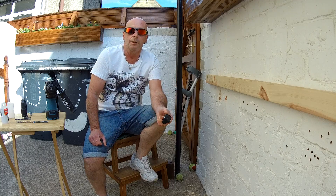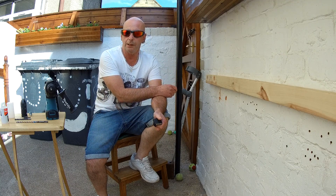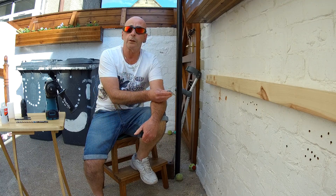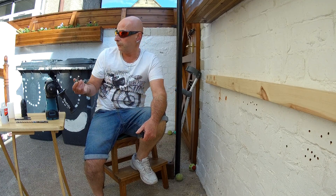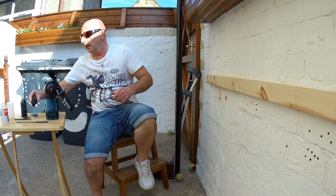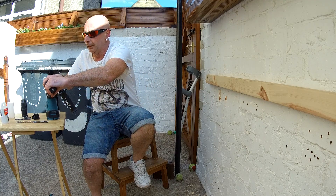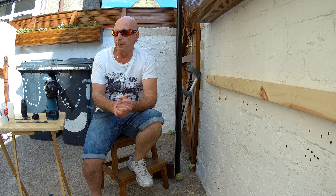Now I've shown you that SDS drills aren't just for drilling in masonry. With the right attachments — the keyless chuck, the screwdriver bit — you can use it for screw driving, for drilling in normal stuff. They may not be as fast as your combi drills, but you've bought this drill, you might as well use it to its full potential. Chuck changing is relatively easy when it's in hammer drill mode, but in drill mode it doesn't like to get changed — and that's a Makita fault, really.